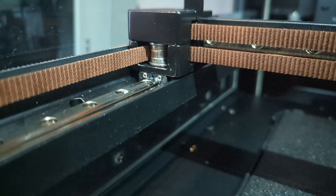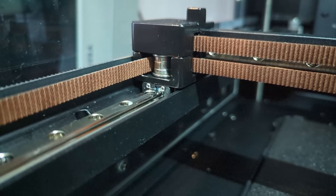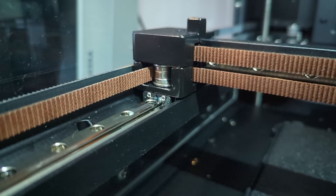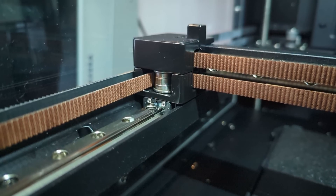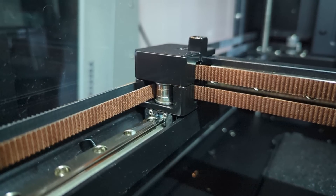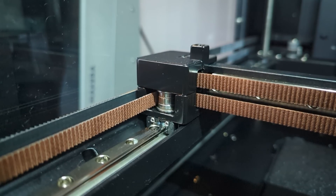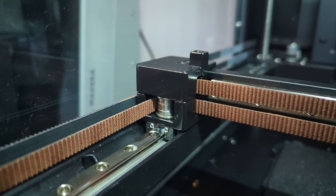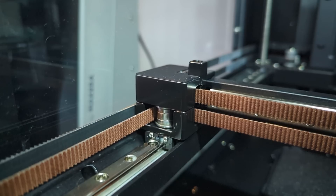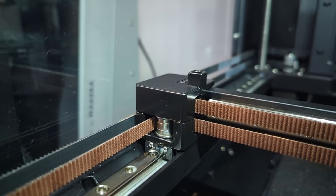As soon as I looked at the XY joiners, I found the printer's first weak spot: the idlers. The devs decided to use an inverted CoreXY belt path, which is great — it reduces the number of toothed idlers to just two. But those two are absolutely critical. Without them, the belt pattern transfers directly onto the print surface. For some reason though, Frozen decided to use smooth idlers here, which are the main source for the massive belt artifacts we've seen. I'd really love to see toothed idlers on the whole gantry. They are only slightly more expensive, but they would massively improve the printer's overall print quality — and in my opinion, they are a must-have.